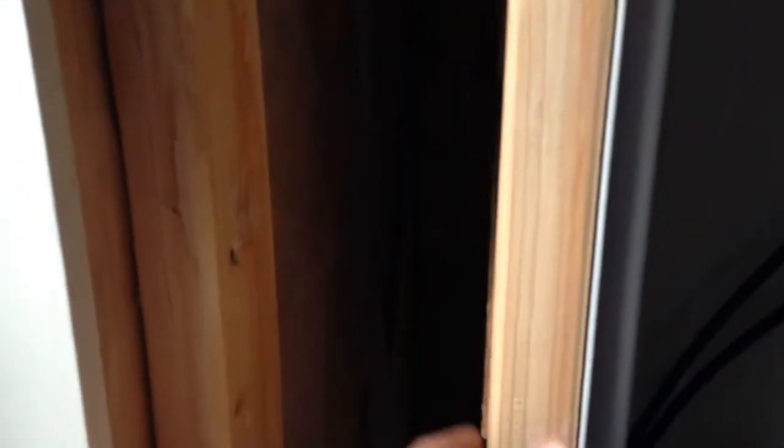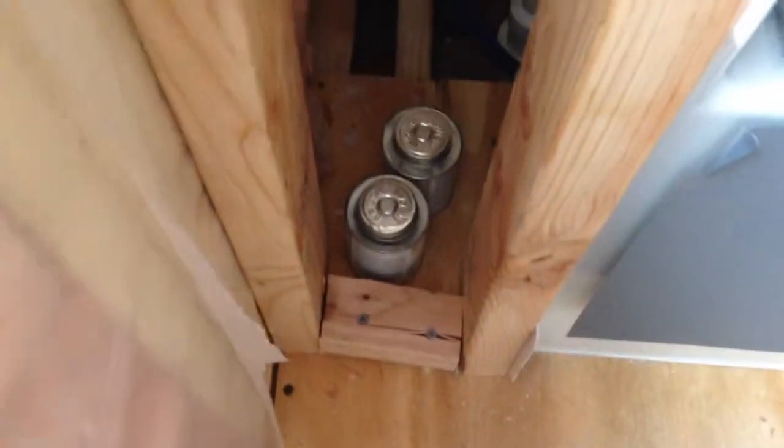What's nice about this is we're going to put a piece of drywall in here, and if something ever happens we have access to the back of the shower where the valve is going to go. We can even reach down and get to our plumbing, so if something leaks it's easy to get at. This is how the bottom is framed — just to give you an idea if you need to do something like this in your bathroom and have a little bit of space and need to build a small offset wall.